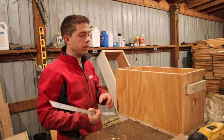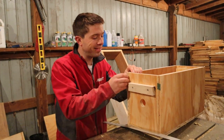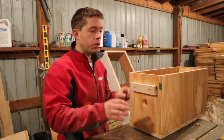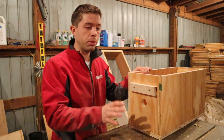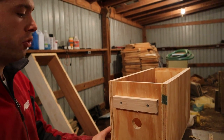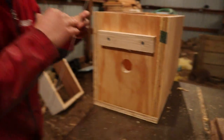This is three-quarter inch CDX plywood. I prefer solid wood, but this works very well if you seal it — you really have got to seal these things. I'm going to be wax-dipping this box, which makes a big difference. If you're not wax-dipping, I highly suggest you paint the insides or seal it with something before assembly. These will last so much longer — they're going to rot anywhere moisture can get to and start swelling and expanding. The middle piece — the one with the frame rest — is seven and a half inches by ten and a half inches.